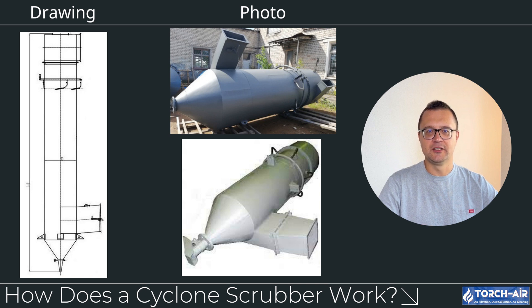How does a Cyclone Scrubber actually work? Let's break it down step by step. First, Cyclonic Action: when contaminated air enters the Cyclone Scrubber, it is forced into a spiral motion, creating a vortex inside the chamber. The centrifugal force pushes larger dust particles, droplets, or solid contaminants toward the walls of the scrubber. These particles then fall to the bottom, where they are collected for disposal or further treatment. This part of the process is similar to a standard Cyclone Separator, a system often used for dust control on its own.